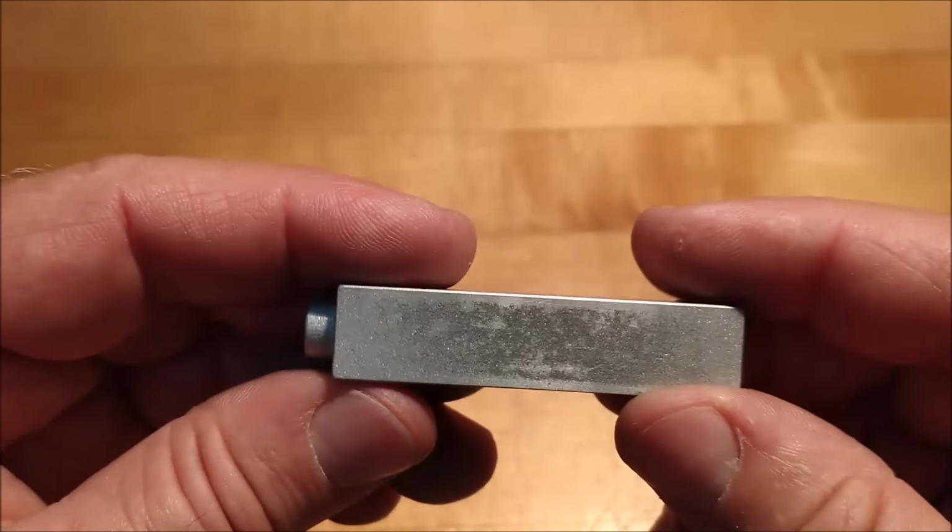An .075, that's not even 2 millimeters, that's kind of small. You know, it's just over 1/16 of an inch if you're Imperial or Yankee or whatever you want to call it. So that's what I'm going to do. I'm going to create the end slots on this part. I'll create the end canals. I will put a groove down the center.